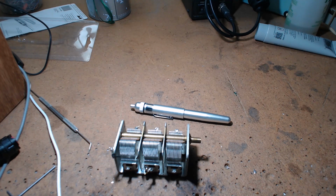Okay? Now, I just wanted to tell you to use a precision oiler. I wanted to show you the toothpick method. All right? I wanted to tell you you're going to need both oil and grease to do a BC348. Why you're going to do it, because it's going to eventually bind up on you. I also wanted to show you those knobs that have that slip clutch thing underneath them. So when you take the knob off, or if you should have trouble taking the knob off, I gave you the information on how to get those set screws out. See, I put a lot into the video.